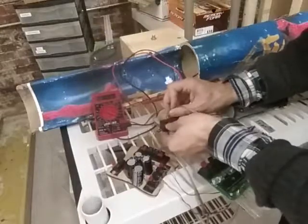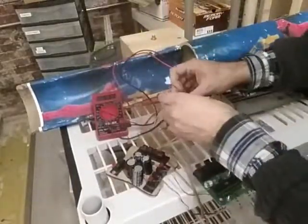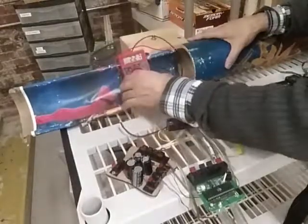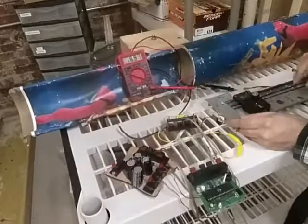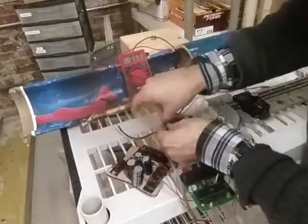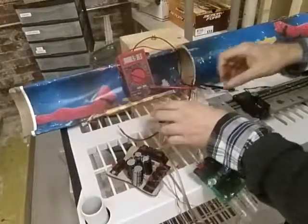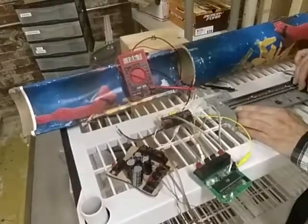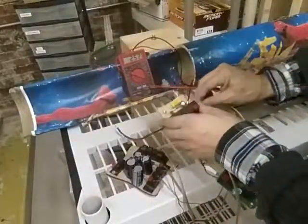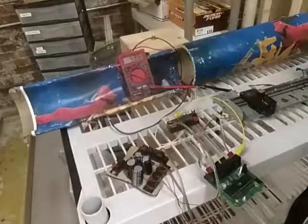Now here's ground, and this is actually the voltage in. We can see it reaches a nice peak of 15 volts. Now this pin over here is the 3-volt out. We already see something on there — it's less than 3 because we're not fully charging. We want to meter the output, not the input. Ready and go — but I'm still seeing high voltage, which means the high voltage is bleeding right through and it's not regulating at all.